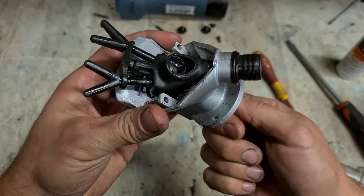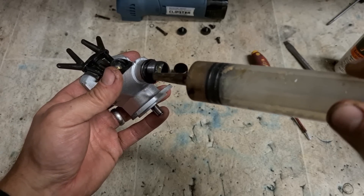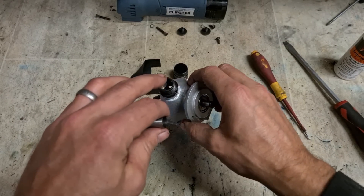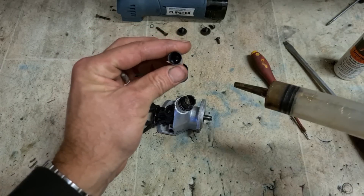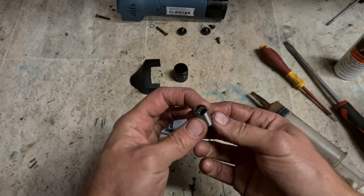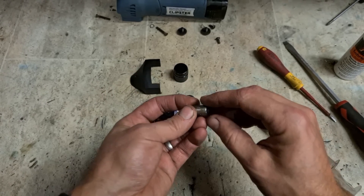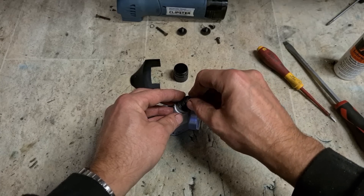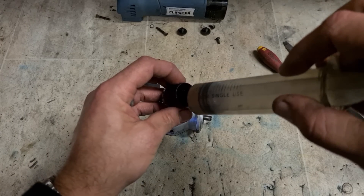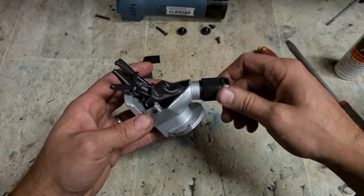Get that pressed in there and the same up here. This pin for putting pressure sits on a ball in this cap — make sure that's got grease in it. Just make sure the outside's lubed as well — just the back of that. You don't need to oil the threads.